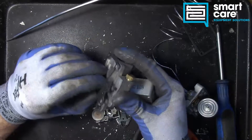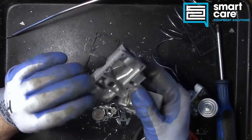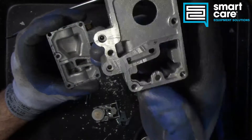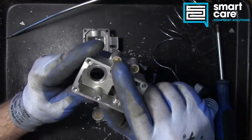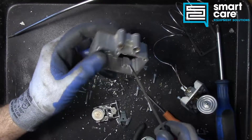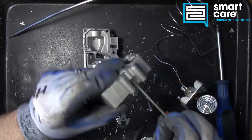Now with the bottom part of the valve opened up, we can see the machine work has some texture to it — it's a little rough — but you can see passages machined into these bodies. Looking at the pilot passage first — labeled P — let's back that screw out and see what it looks like inside. It's probably going to be very similar to a carburetor jet, where it has a taper to it, and as you back the screw out further, it changes the amount that can flow past the tapered part of the body.